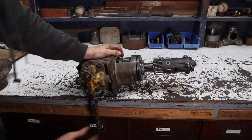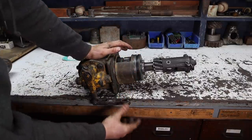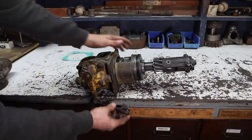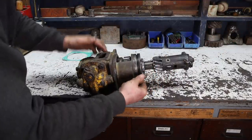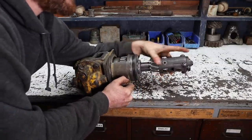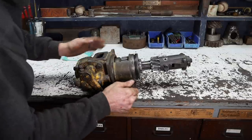So here's the way this clutch works. Essentially, there's a lever in the cab on these 955s. It's different than on the D4s and the D2s. You have one single lever, and you engage the diesel from inside the cab, basically where the operator sits, rather than on the side of the motor here. And so this does not have brake discs like D4s and D2s. Essentially what you do is when you push in the single knob, it pushes this disc into a cone, and then that breaks this so that it can spin till you push that, and then it stops it, and then that slows it enough, and then you quickly pull it the opposite way, and what that does is that releases the brake.